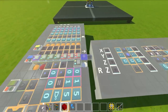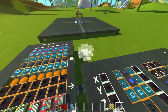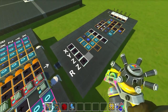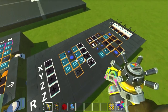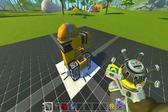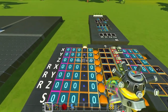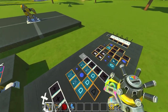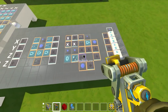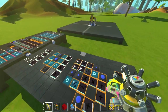The lower module passes information to the specific robot controller module, connected by just four wires. Every time we feed an XYZ and RZ position, it verifies that the position is outside the restricted grid. If the position is inside the grid — within three blocks in every direction — the robot returns to its default rest position. Then it does some Cartesian math using cosines to figure out what angles it needs to be at and sends that information out to the motors.